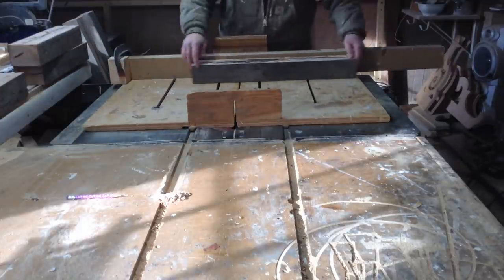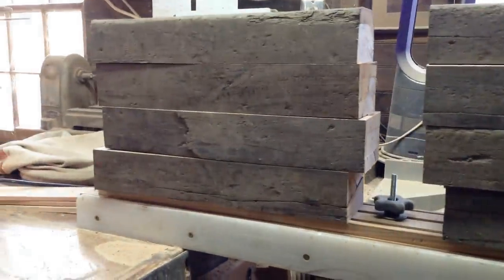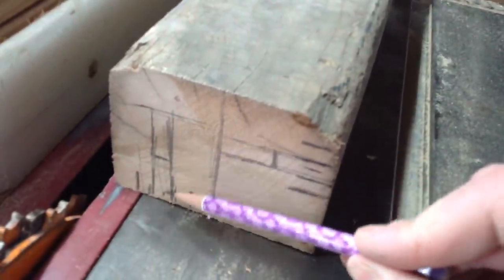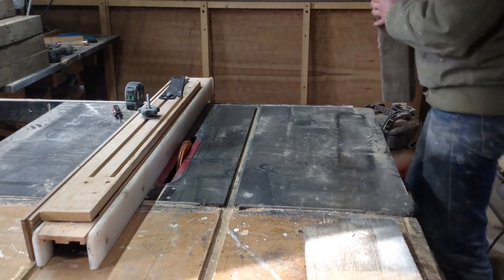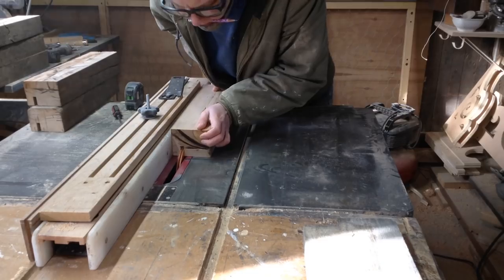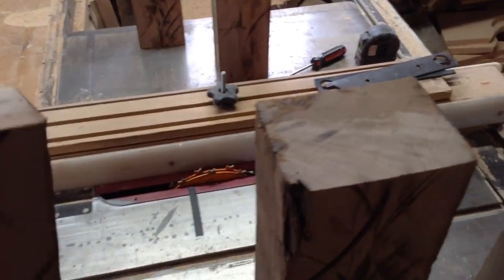The benches are about 18 inches tall. I knew the top was going to be around an inch thick so I cut these to 17 inches. Even though this is still pretty rough lumber, just with cutting it on the table saw they're still pretty flat. I've been making haunch tenons and haunch mortises recently — it helps with twisting and bowing of the aprons over time. To expedite the process I cut what is going to be the haunch with a dado stack so I don't have to cut the whole thing on my mortising machine, because the mortising machine is great but it's kind of a slow process especially when cutting really deep mortises. This is a 3/8 inch stack and I can only cut four at a time, then I'll have to transfer those marks to the other side.